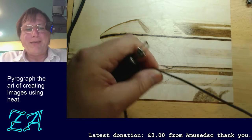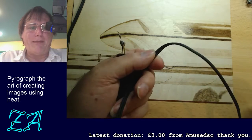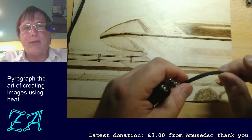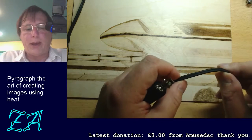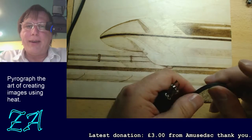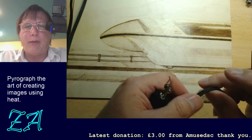Heat. If you get too much heat in this cable, you might melt the insulation, for example. If it's a meltable kind, that would then short the wires, which would then cause more heat, and then you could easily get a fire if you're not careful.